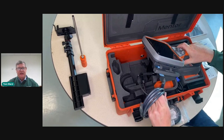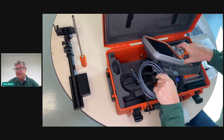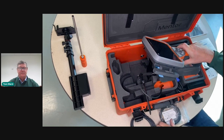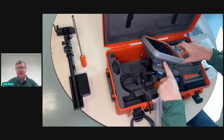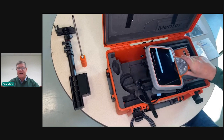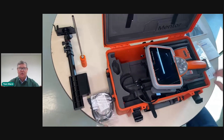Next, I want to show you the IO port. Here's where we have the HDMI cable — in the previous version we had a DisplayPort cable interface, but HDMI is very popular now. With HDMI, you'll be able to connect to an external monitor, for example. You guys asked for that change and we went ahead and made it. We also have what we call an A-to-B connector — this is a USB cable that allows you to connect to a PC. By using this, it creates a mass storage device allowing you to move files off the IQ and onto a PC, or vice versa.